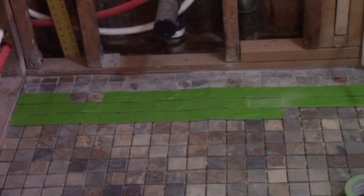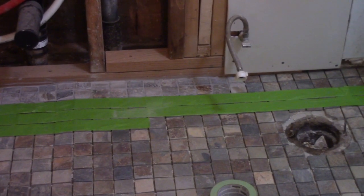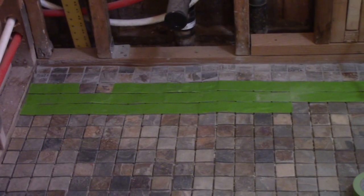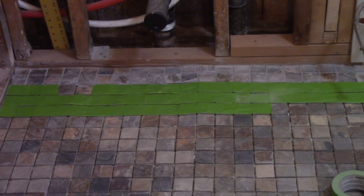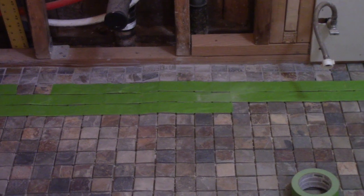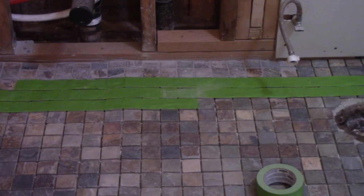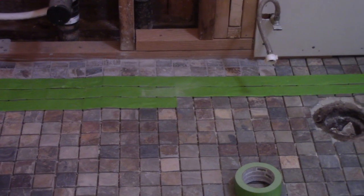So what I'm going to do is mask the tiles. Like there, I've masked two grout lines, and I'll just put the grout between the masked tile. This will actually be quicker because I'll only have to mask the tile — I'm not going to have to do the cleanup and a significant amount of scrubbing to restore the slate tile to its original color.